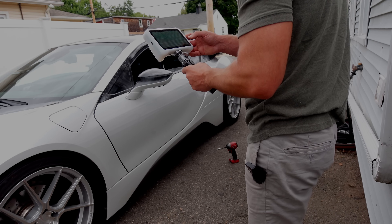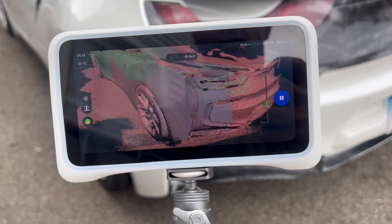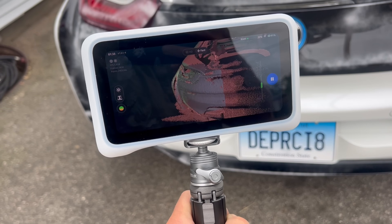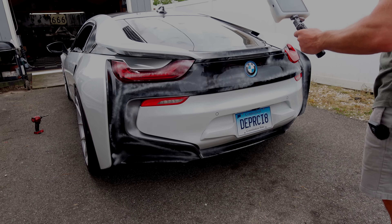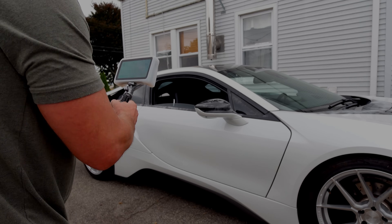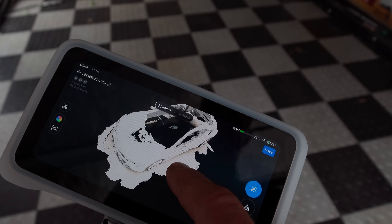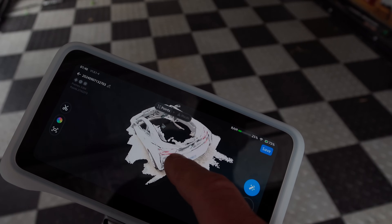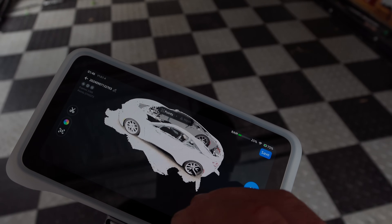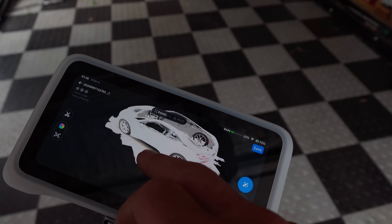Being an all-in-one, one of the first convenience aspects I noticed was being able to freely walk around the car without having to reposition a laptop or move cables around. You can see from the screen that the field of view is really quite large, and this goes a long way in helping tracking — it keeps a large number of unique features in view at all times and mostly eliminates the need for any sort of markers. I did a pretty poor job of applying the scan spray, so we have some gaps and voids, and I didn't spray the rocker panels either. Even so, we've got a nearly complete scan of the car. The scanner didn't crash and did pretty well with tracking, primarily thanks to the large field of view. When I tried to scan my i8 previously with the Einstar, it would really lose tracking around the doors where it was flat and I didn't use any markers. So this scan was done with zero markers outdoors, which is pretty impressive in itself.